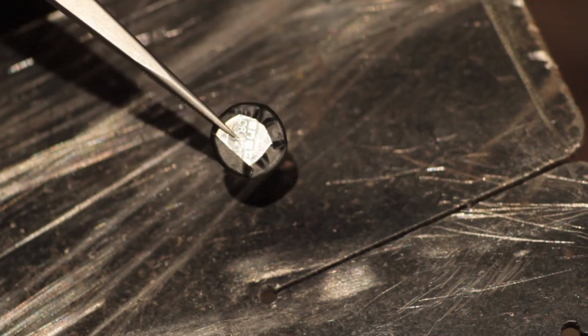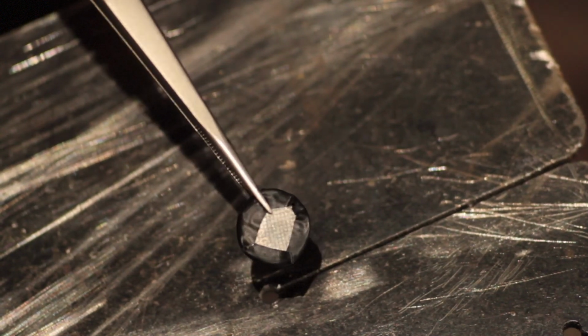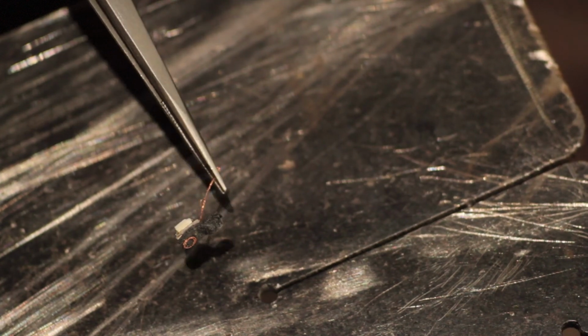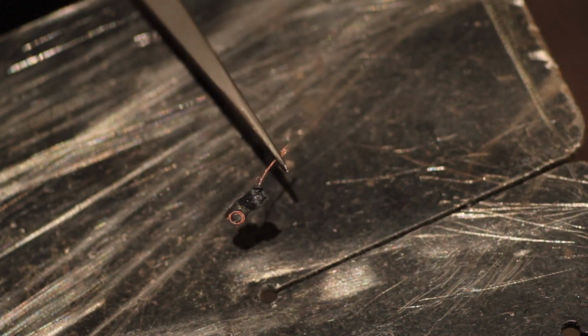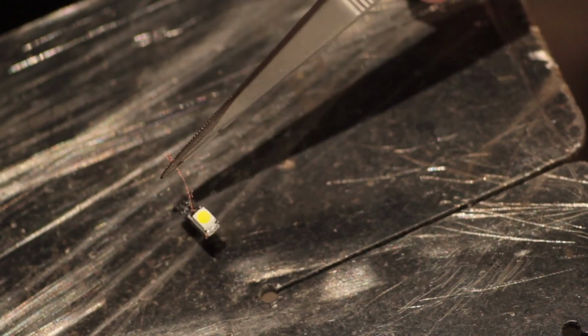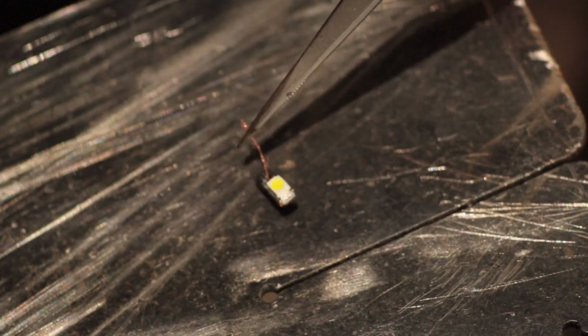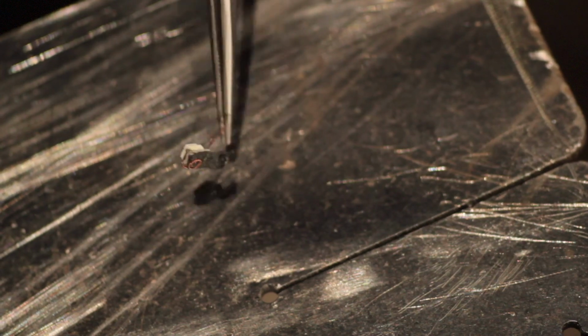This is what the battery itself looks like. It's a regular 3-volt coin cell, though the edges have been wrapped in an electrically insulating strip. The real magic comes from how the LED is arranged. It's a bright, pure white modern LED. It sits on a piece of double-sided adhesive with one wire lead coiled beneath it. This arrangement ensures that the negative side of the circuit is always in good contact with the battery.